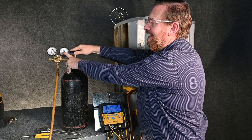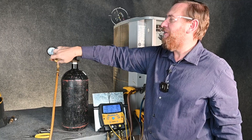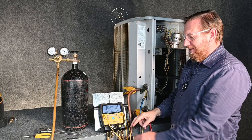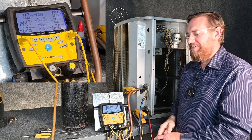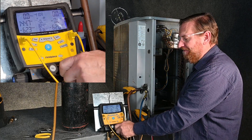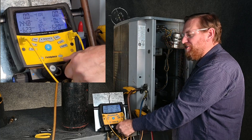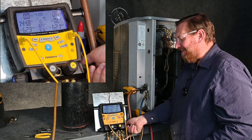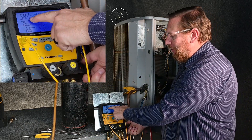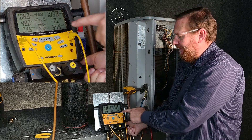Now we're going to open the valve. We can confirm that we have pressure in the tank — we're above 500 PSI. We're going to increase the pressure in the hose to 300 PSI. Now I have 300 PSI coming to my manifold gauge set, so I'm going to put that nitrogen into my refrigerant lines. We're going to open up the REF to allow that pressure into the manifold gauge set itself, then open up the high side to allow that nitrogen gas to flow through and I'll watch my PSIG here to get it up to 150 PSI gauge.